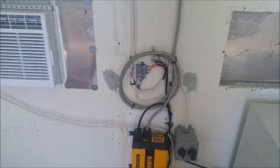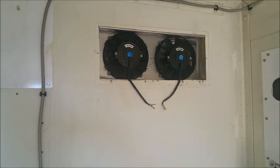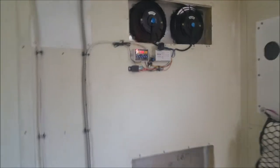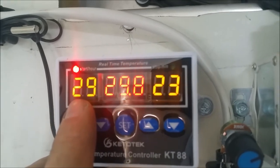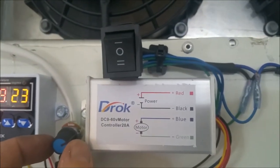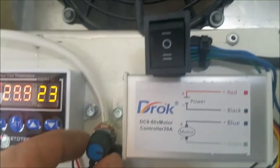I've got a space left on my fuse panel so I'll get those wired up and see how they work. Alright guys, I got this fan setup wired — everything's in Celsius. The center display is the actual temperature; this setting is when you want the fans to start and this is when you want them to turn off. This right here is a motor controller, and that switch is basically a reversing switch — it'll reverse the flow of the fans. Right now I have them blowing out, and this turns up the fan speed.